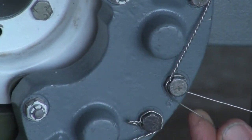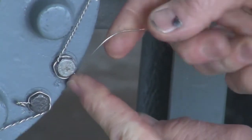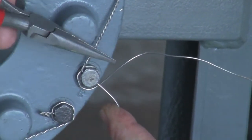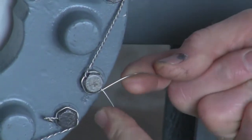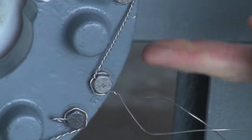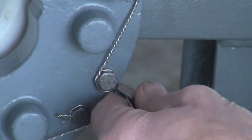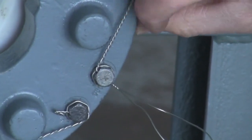On this one we're going to swing around the bottom side of the bolt. This time, if I twist to the right it will tend to pull this half loop on top of the bolt head. To prevent that, I'm going to twist this one to the left. As we do that, it will keep that half loop down on the bottom. Once again I use my duckbill pliers, give it a couple of twists, and make sure it's nice and tight.